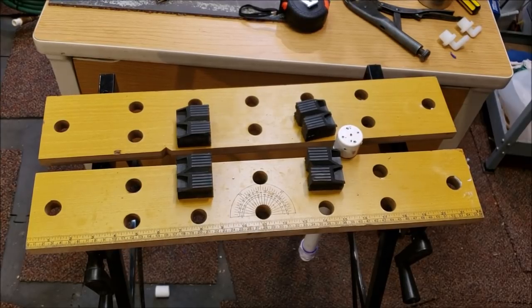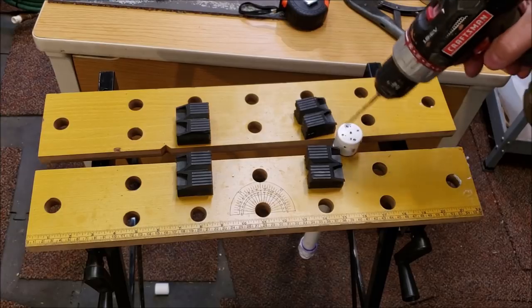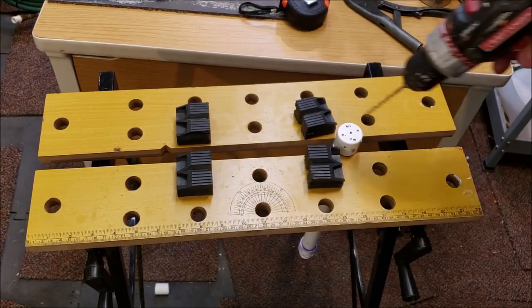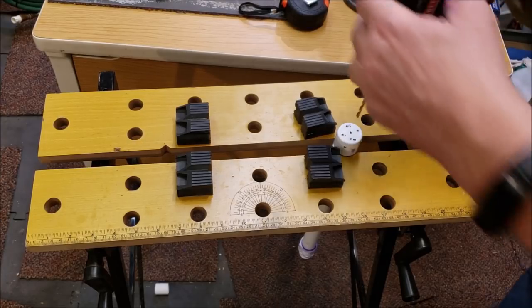I went through my spreadsheet and figured out the internal diameter of three quarter inch pipe and how many holes I can drill based on flow capacity. I'm going to use 5/32 inch drill bits and one eighth inch drill bits. Based on the calculations I'll drill nine 5/32 inch holes - five in the top and four around the edges - and 16 of the one eighth inch holes.